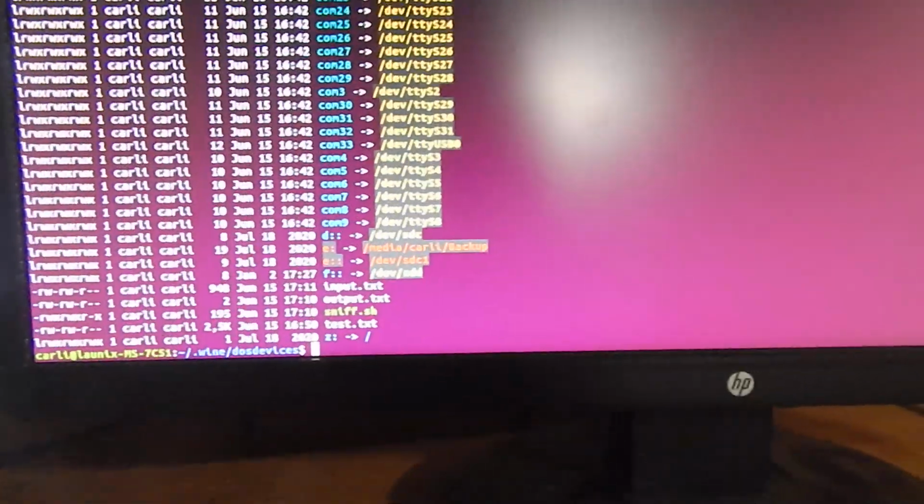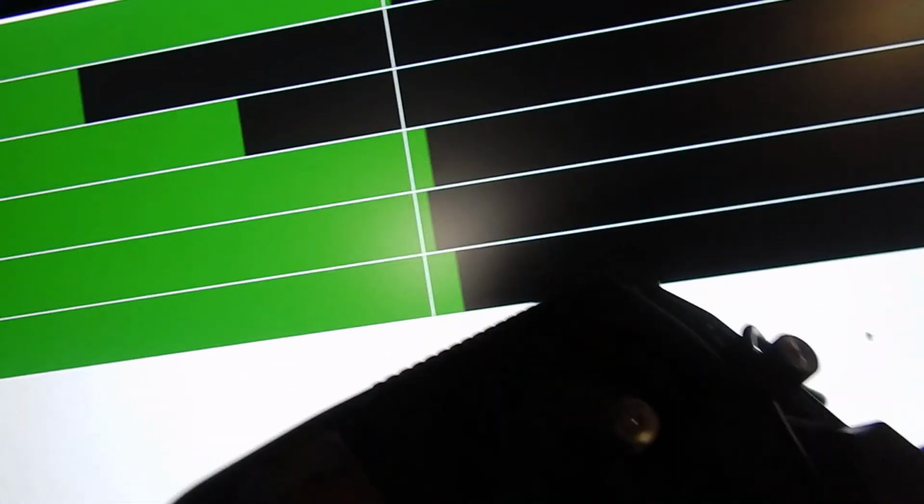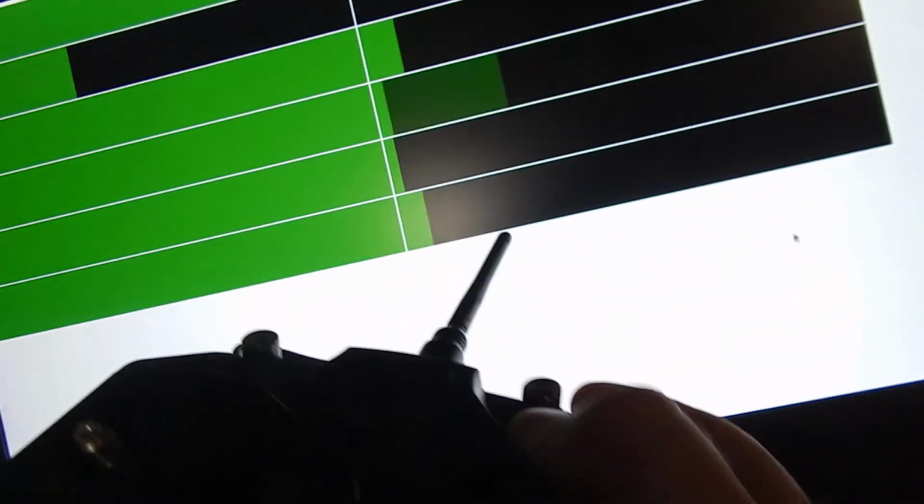And then I somehow reverse engineered the UART protocol. This remote control has a cable, and this cable builds up a UART connection with USB to the computer. I just sniffed a bit in the UART protocol, and I came up with a cool program that reads out the same values but puts them to a Node.js program. This is it. And now I can just normally do the same as here.